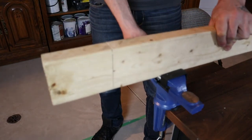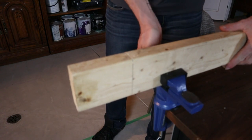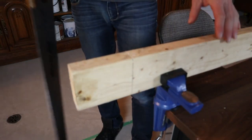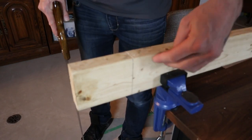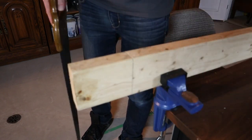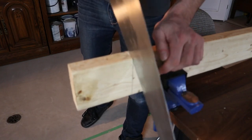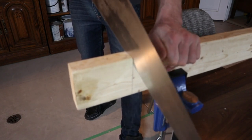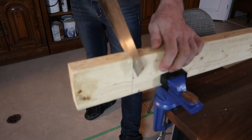That's a technique I tend to use with a thicker piece of wood, but if you're cutting a two-by-four or something like that you can probably just keep it clamped in and start cutting through. The closer you cut to your clamping system, the less it's going to move and the better it's going to be. You want to keep an eye on your line as you go down.